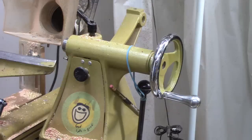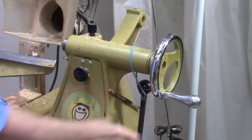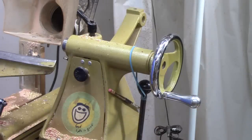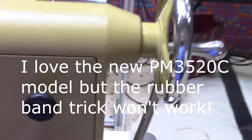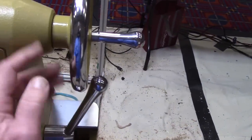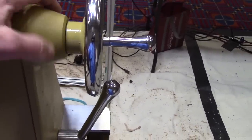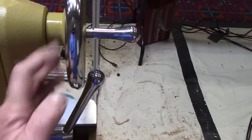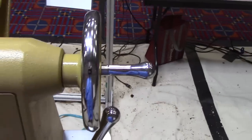Here's a couple of little things in my Powermatic I want to show you. Here's how I use a large rubber band to keep the lock on the tailstock in a neutral position, and I find that helpful. I like to put a rubber band to keep this in a neutral position. There was a flat spot on the B model, but there's not on this one. You've got to figure out how to fasten it here without tearing up the rubber band because it's on your hand wheel and as you turn it, it's going to keep breaking that rubber band.